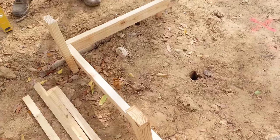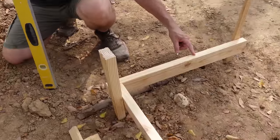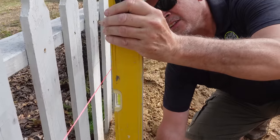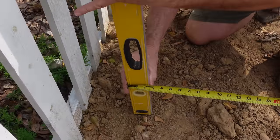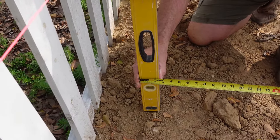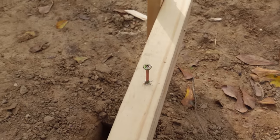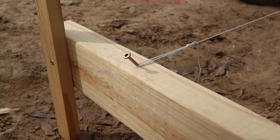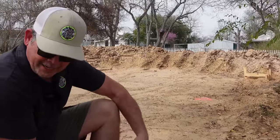All of our batter boards are installed. Now it's time to start doing our building strings on the edges of the slab — the layout that defines the edges of the foundation. We're going to come off this dry line four feet and make a mark on the batter board. That mark will be five feet from our property line, since the dry line is already one foot away from it. I'll plumb down with a level, hook a tape on the back, and Rad will make a mark at four feet. Rad's putting a screw right there above that arrow — that's our string line, representing the right-hand building line against the property line.